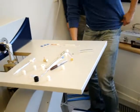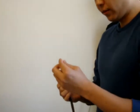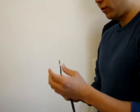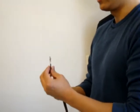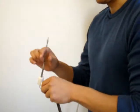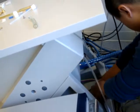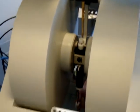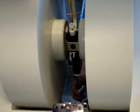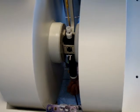Okay. So now we're gonna. So this right here is actually the heater thermocouple, right? Yeah. So this thing at the tip is the thermocouple, while the heater is coiled up around it. So this reads out the temperature while the coils heat up the nitrogen, right? And you basically stick this thing through the bottom of this nitrogen duo here. Through this white plastic piece, there's a hole here. Yeah. And you simply just wanna wiggle it around a little bit and just push it through.